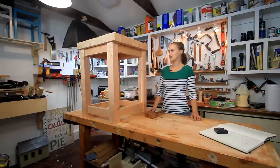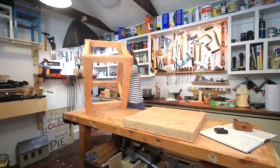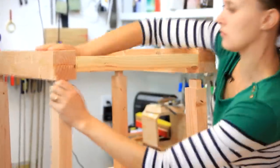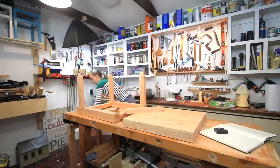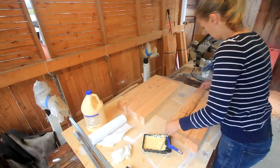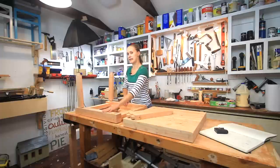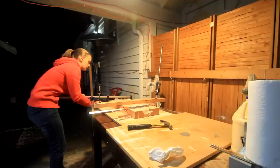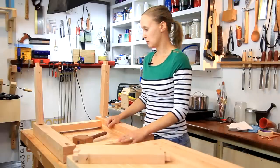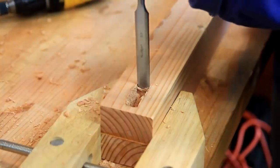This is my new Vensa table and today I'd like to think about joinery. This project is all about long grain to long grain gluing. The top is laminated together on the long grain. I connected the legs together by gluing two pieces of wood together, so it only seemed reasonable to continue this into mortise and tenon joinery because that is very strong.